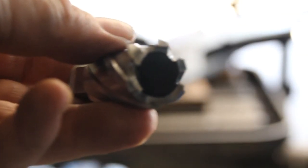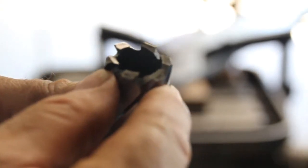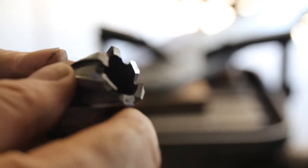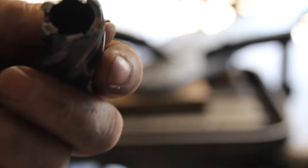I just wanted to give you a look at the geometry on this blade. It's a little bit different — I don't know if you can see those notches in there, but it seems to be taking two levels of cut. There's a bevel on that piece as well, so it's sort of taking a core cut and then finishing off the outside shade after the core is cut. Nothing unusual about the inside face of it. Maybe it's just in the way the teeth are cut that makes the plugs come out easily. It puts a nice finish in the hole, as good as you'd expect from any annular cutter.